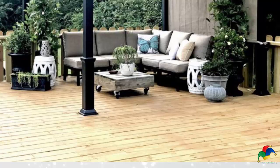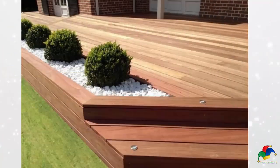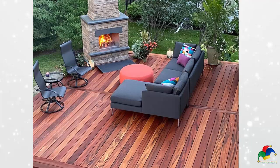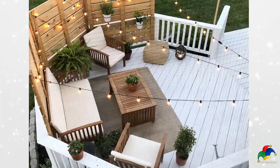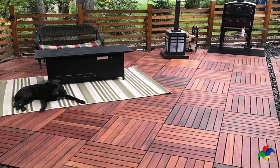The biggest challenge for restaining a deck is to make sure it's clean. Sweep it thoroughly and use a screwdriver to clean out debris between the decking boards and butt joints. Clean obvious grill spills with a TSP solution. Apply a quality deck cleaner according to the manufacturer's directions. Thoroughly rinse the surface with a garden hose or high-pressure nozzle attachment. Pressure washing isn't recommended — linger too long in one spot or use too high a pressure setting and you're likely to damage the boards. Once the deck is thoroughly dry, sand down the fuzzy spots with 80-grit sandpaper and sweep up the residue. Then apply a fresh stain. You can change the colors by going darker, but lightening it up won't work.